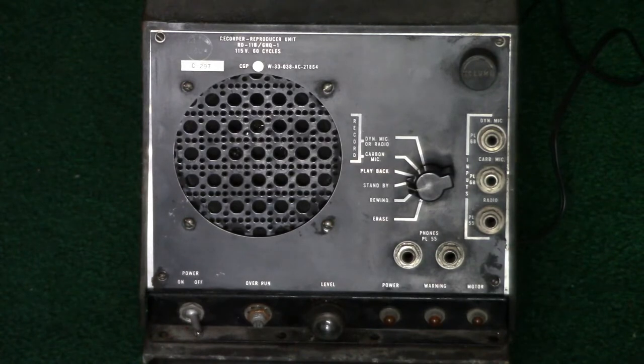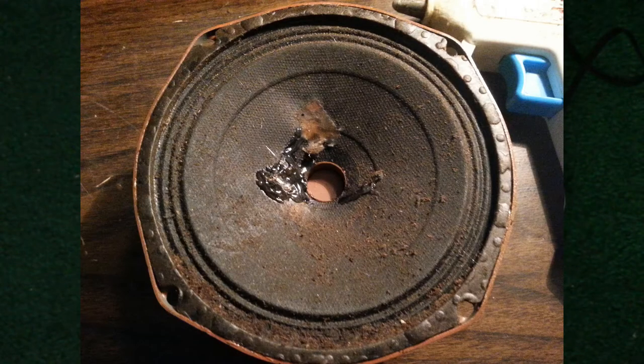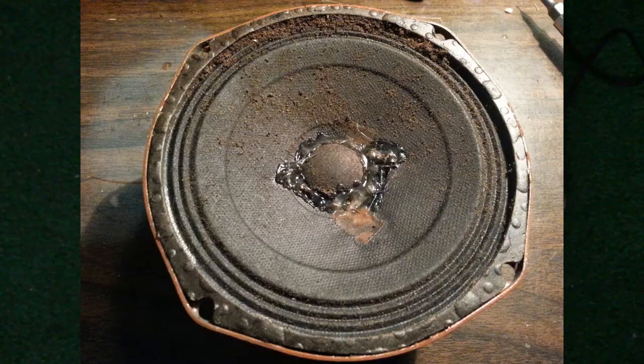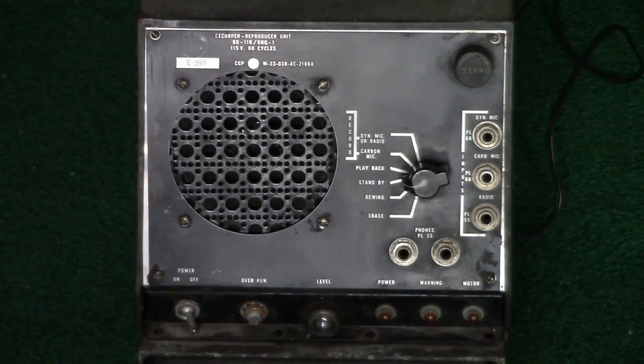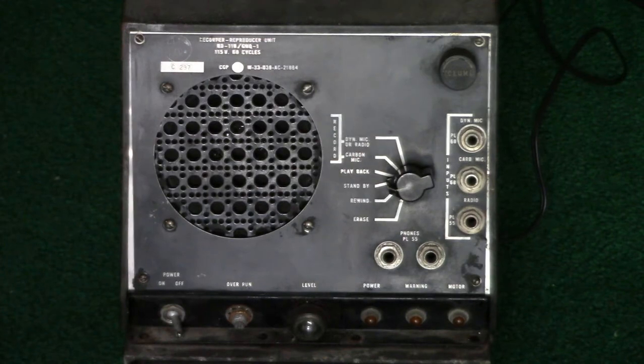It turned out that one of the bonding wires, voice coil wires, right where that bonding wire was, the speaker had been punctured and the bonding wire had broken. So I re-soldered that little voice coil wire, and I bridged the connection with a little piece of wire and was able to re-solder to complete the circuit again, and put a lot of hot glue over that, and also glued the dust cap back on, which had come off, and have made the speaker function again. It's an old Jensen 5-inch driver, and it was on the back of that speaker where it mentioned the date of 1948.